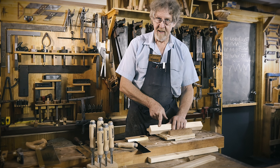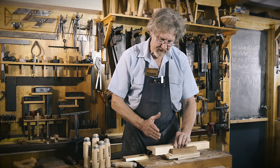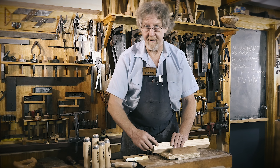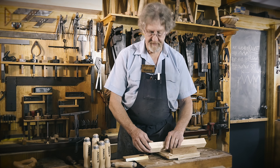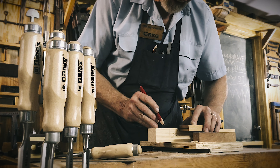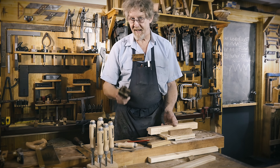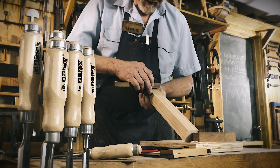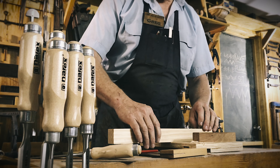The reason I've done the scribe line down here is because as I cut down there with a saw, I have pre-cut the fibres. So when the saw is cutting through, it should mean we have a greatly reduced amount of fibres tearing back on this side of the line. That's why I've opted to mark the joint out using scribe lines instead of a pencil, though I've just used the pencil to help me initially. I'm fishing for that spot down here, coming back in from my marking gauge, remembering to do it from the same direction. So we're measuring from the top side.